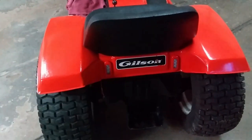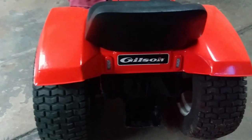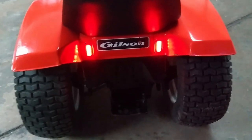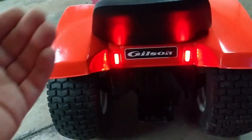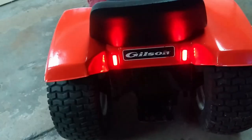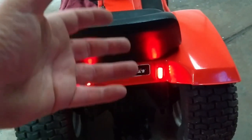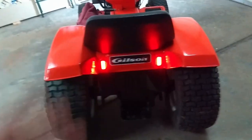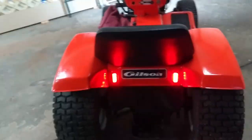The tail lights showed up about 20 minutes after I stopped recording. Had to paint the bezels. This one's a little off because the dipstick tube for the hydro is right behind it. I mounted them under here near the hinge point — that way I didn't need any extra cabling, I can just tilt the seat back, and there's no risk of wires getting caught during snow throwing. They're wired right into the headlights, so when the headlights go on, the tail lights go on. The idea is mainly so a car going by will see me when I'm snow plowing.